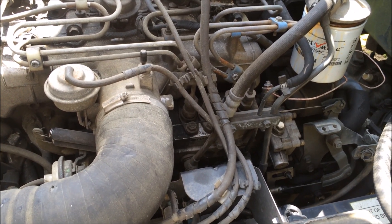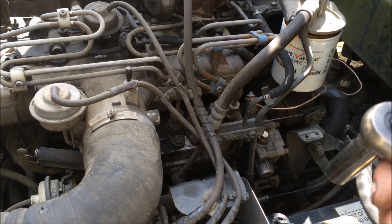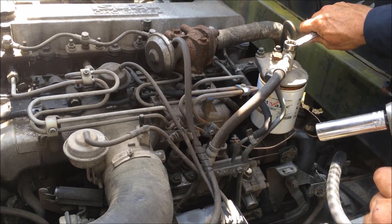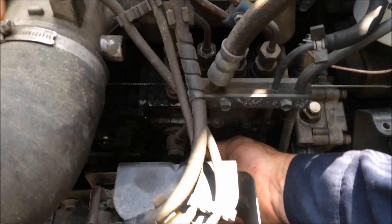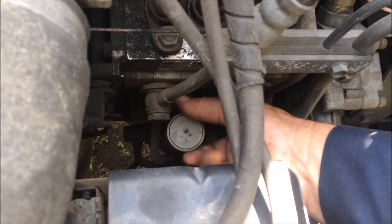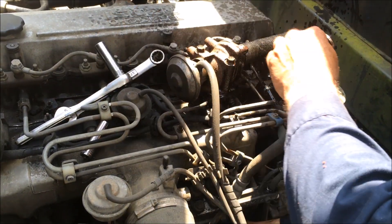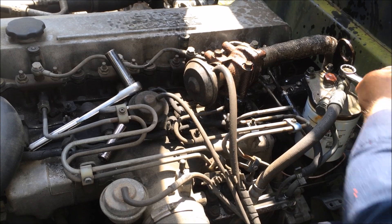Once you get your pump installed, or if you run out of fuel, here's how you prime your fuel pump. First, loosen your outlet banjo bolt on your filter housing. Then loosen your primer pump by turning it counter-clockwise — it'll come up. Pump it until you've got nothing but fuel coming out with no air. Once you have just fuel and no air, tighten it back — snug it up good.